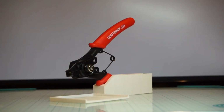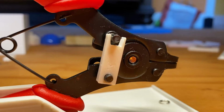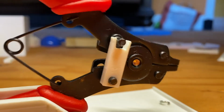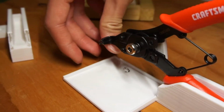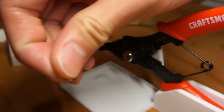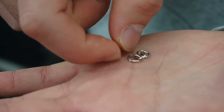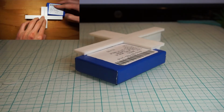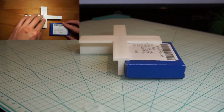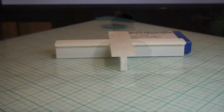As for the winding process, a 3D printed jig holds the snap ring pliers upright, while a stopper prevents the pliers from opening too wide. Underneath the ends of the pliers is a white plate that can catch the O-rings after winding, and allow workers to easily locate the O-rings on the plate's surface. The last device is a label aligner. This 2-step design allows workers to insert boxes in multiple orientations, and then simply align the stickers to the corners and place a perfectly centered sticker.